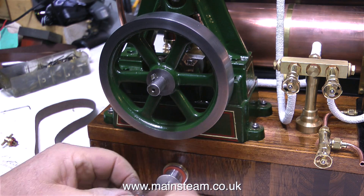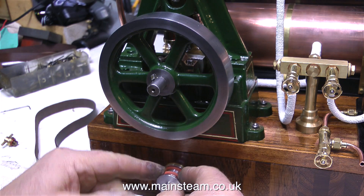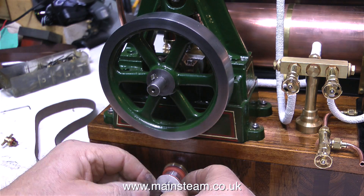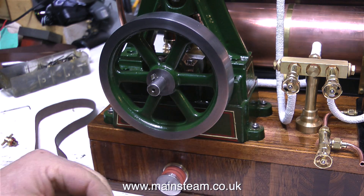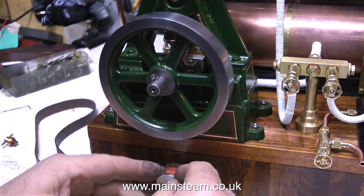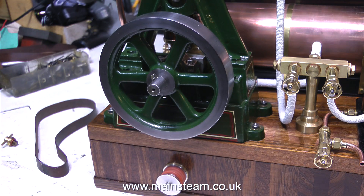One problem I thought I was going to have was friction on the aluminium pulley — aluminium is quite slippery as far as metals go. And just as I thought, the belt was slipping on the pulley: because of the internal gearing up of the generator, when I put it under load the pulley started to slip. I considered using a knurling tool on the pulley but thought that was a bit severe and would wear the belt. So instead I'm using some silicone O-rings — some metric O-rings bought a while back for general purpose usage.